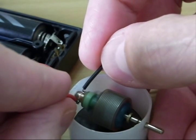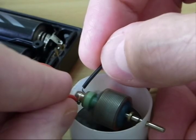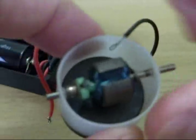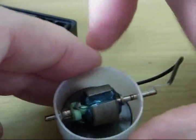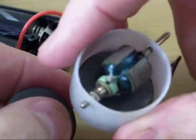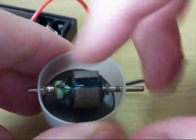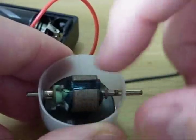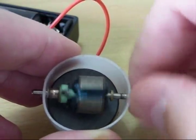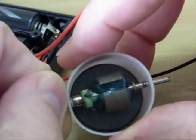This is how it works. You just have two brushes — I am directly putting the electricity on here. What is happening is the magnets on the armature are alternating north, south, north, south. The bottom magnet only holds the other magnet in place; otherwise it tries to stick the armature. All it is doing is these things are alternating north, south, north, south, causing it to attract and then repel from the magnet on the bottom. And by adding power right here, that is how one of these little DC motors works.